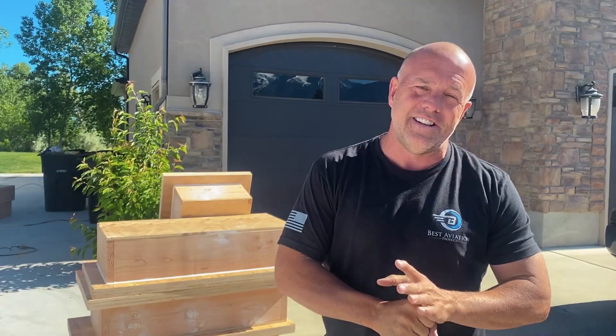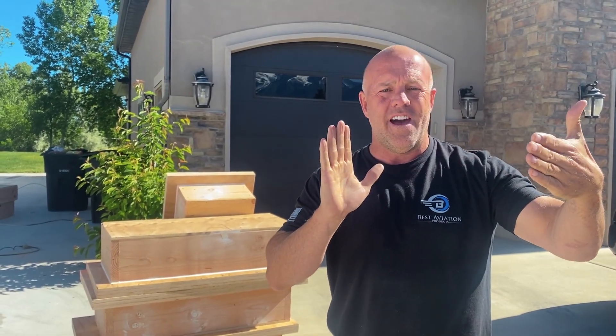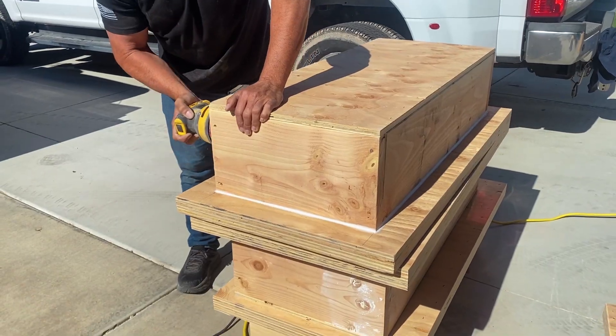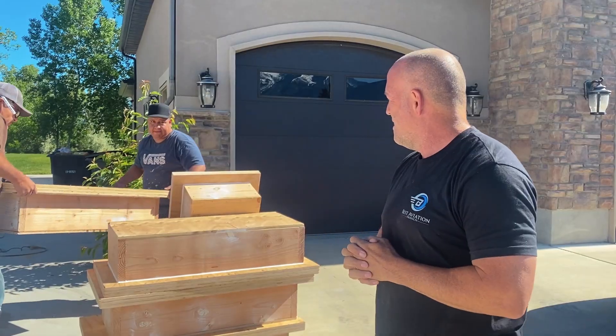With no tapered edges, these boxes are going to be hard to get out of the concrete — they're just temporary forms. We're going to screw them to the side of a concrete form, screw the other concrete form to the other side, and when we pour the concrete it will wrap around this box entirely. We'll use a vibrating stinger that shakes the concrete and makes sure it gets really tight. Since there is no draft on this, it's coming out with a sledgehammer and there'll be nothing left of these boxes when we're done — this is a one-time use. We have 12 of them to make, to put 12 two-foot by four-foot windows inside the swimming pool so you can see in and out, and also to let daylight into the 24-foot deep section of the pool to light up the big black hole in the bottom.